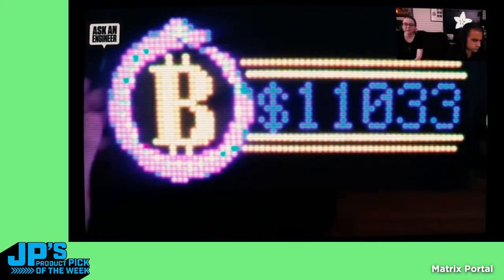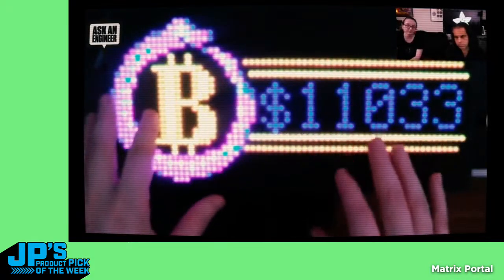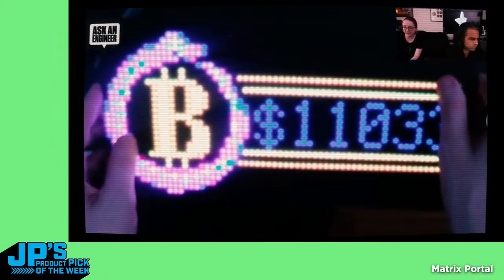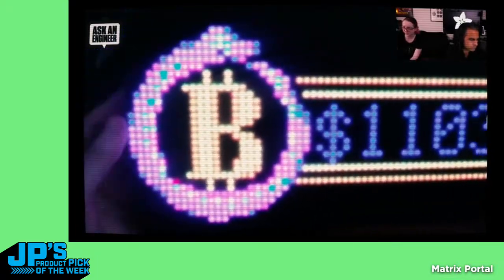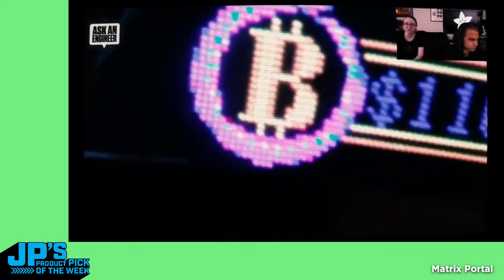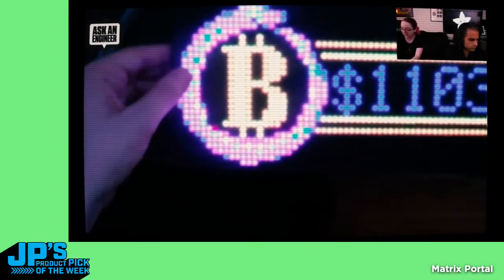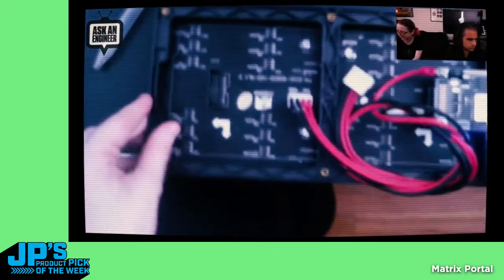And here's a demo. It's just going online and getting the price in Bitcoin. Congratulations, it's about $11,000. So this is running CircuitPython, so it's very easy to make RGB matrix projects. You can chain the matrix. In this case, there's only one attached right now, but you can make a long string of RGB matrices as long as you don't run out of memory. And the SAMD51 has 192K, so you're good for quite a bit.